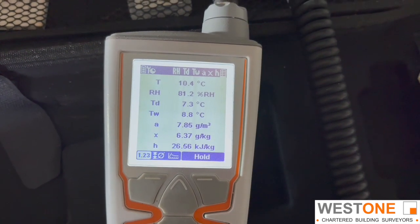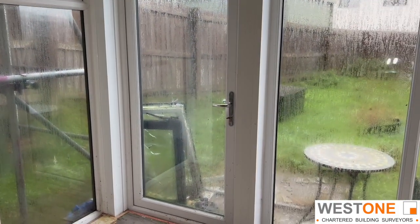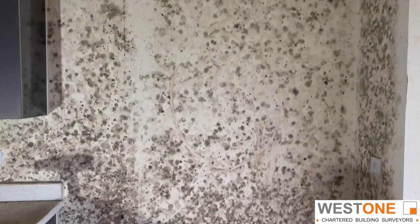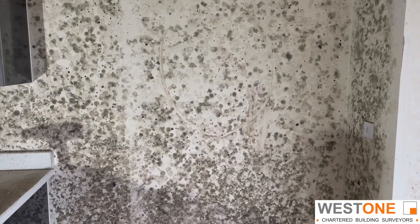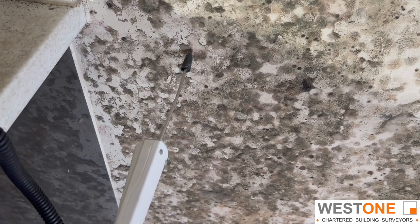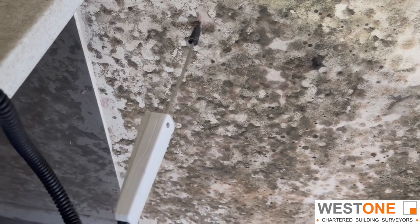But that's only part of the story. So let's see what's happening in the brickwork of the walls. These have been saturated by extinguishing water - I'm in a basement level here, built into a hillside. The fire was on the first floor, so the rooms directly above have been saturated and this has all come down. I'll drill into the wall and we'll see what the temperatures and humidities are doing in there. The principal reason for doing this is to ascertain, once we get this plasterboard off, are we likely to need dryers in here to dry the block work? More than likely yes for upstairs, but this is more just for a demonstration.